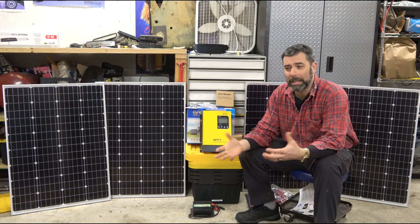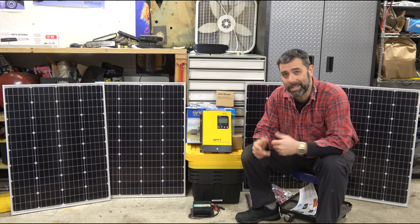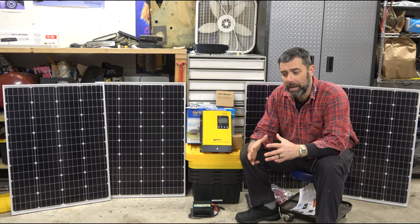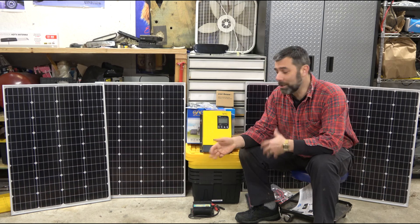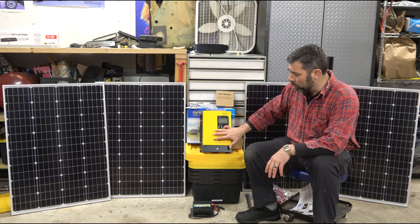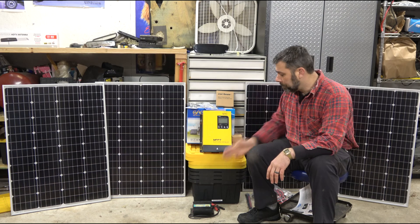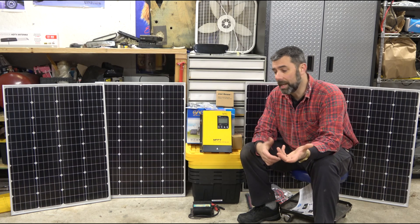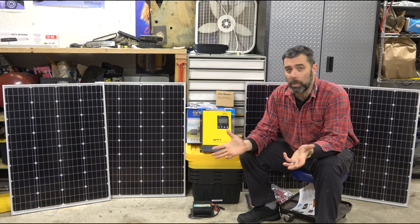That's it. I'm Eric, owner of Farpoint Farms — glad you came by the channel. If you're interested in renewable energy, this will be kind of the poor man's version of how to do this smartly. The whole point is so you don't make the mistake of buying a small starter kit thinking you'll expand it later, only to find out that other than the solar panels, all your other equipment is maxed out. By investing in an expandable charge controller — this one can go up to 3000 watts at 48 volts or 1800 watts at 24 — and a proper inverter, you avoid having to replace everything the moment you want to grow.